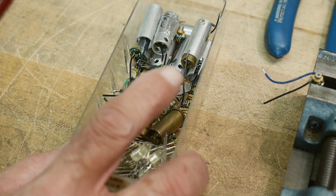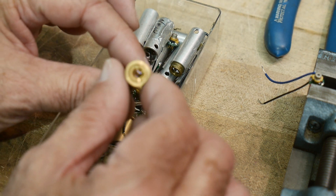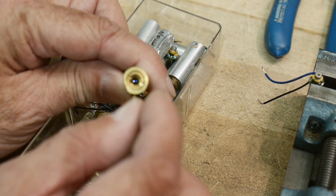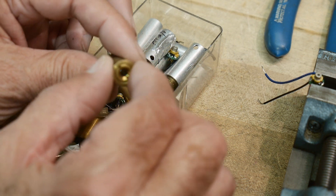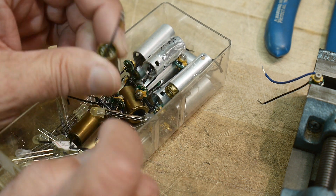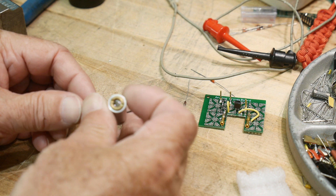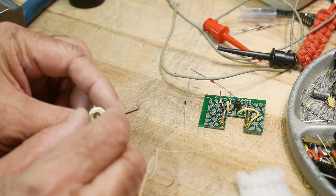Let's take a look at a couple of them. These look very familiar. The diode inside has this little lens on the front, and this little thing allows you to focus the lens in and out to make the beam nice and parallel, or make it to a spot — whatever you want to do. You can focus the lens. So this is the focus mechanism and the LED is inside. Here's another module — aluminum body instead of a brass body, but it has the same lens and a little brass lens with a focus knob on it.